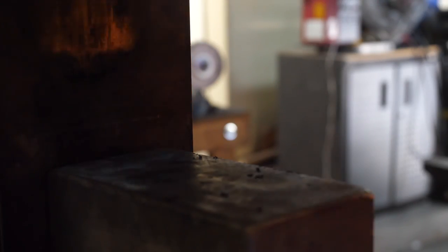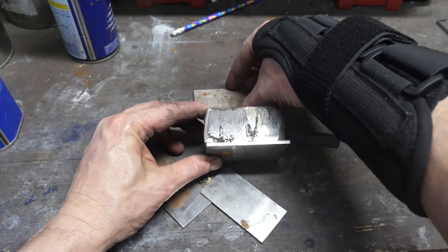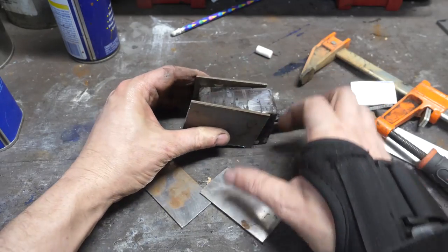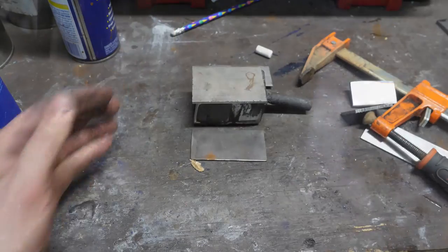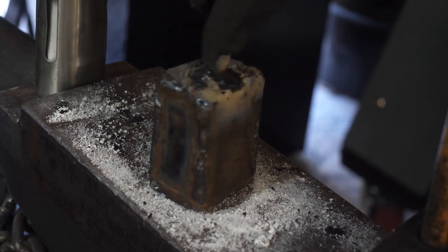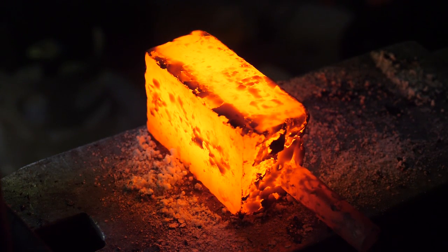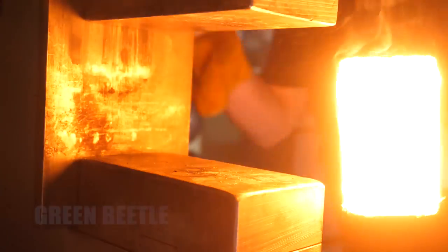What you see here is that I've re-welded the handle to the bottom of my billet and I'm using it to square it up a bit better before moving on. The plan is to forge weld this mild steel to the outside of our billet to help prevent splitting of the ends and sides as we divide the billet first and then re-weld it and draw it out, which can be quite stressful and pull things apart. It also provides an oxygen-free environment I'll use to forge weld the billet together with a few light presses one more time before we split it. But first I have to get these sides welded on, then reattach the handle to come in from the long side. Then we'll press it tight, make sure all the welds are good, then time to divide it.